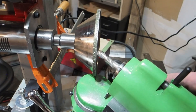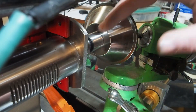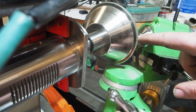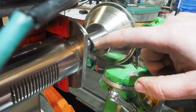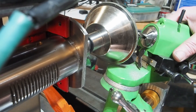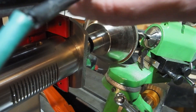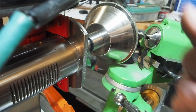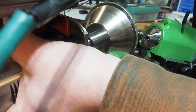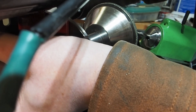I really don't know what I'm doing. It's hitting. So this is the reason I'm glad I mocked this up - I tried to get the center to coincide with the center distance between the center of the tool and the center of the bar, to coincide with the center of the grinding spindle. But you can see right here that it's hitting, or it would hit. So I actually can't get the position that I need because I have to move the motor up. None of this is set up with any level of precision whatsoever - it's all just clamped together roughly.